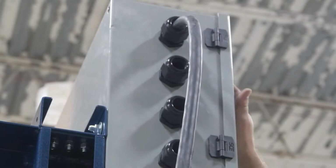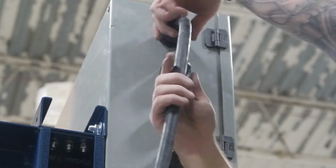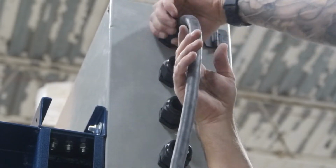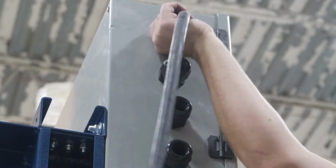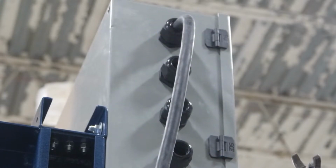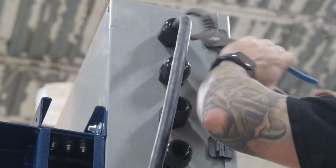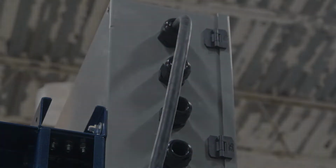Once the wire connections are secure, move to the outside of the housing box and hand tighten the fastener until snug. Using a wrench, apply approximately a 1/8 turn to further secure the cable in place. Be careful not to over-tighten.